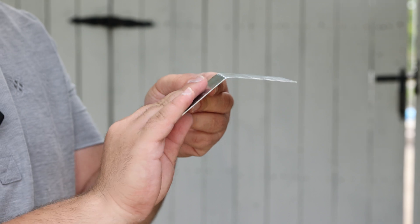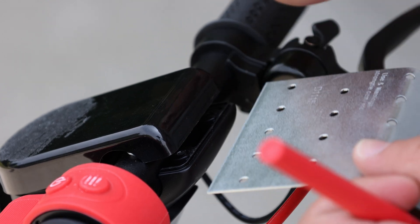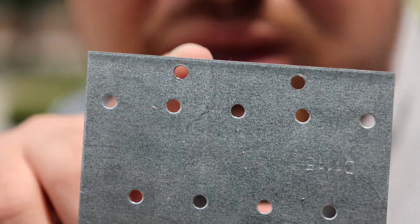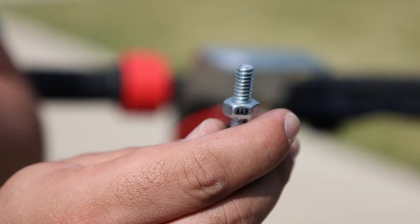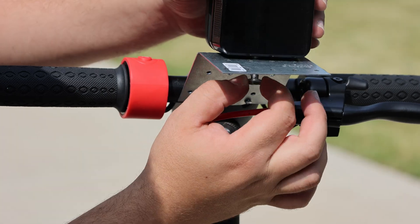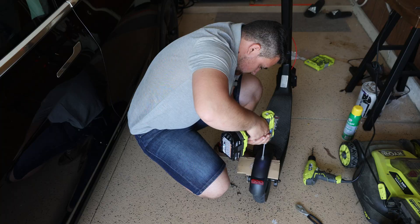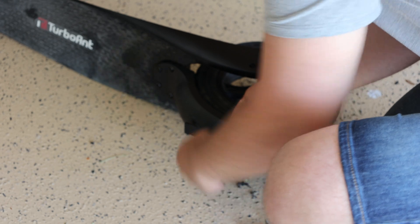With the plate bent, this part goes into the scooter and this part will be flatter, allowing the iPhone to map more of the scene. I mark where the screws belong, attach a one-eighth inch drill bit, and drill two holes into the metal plate. The two holes are spaced correctly to attach to the front of the electric scooter. I tighten the screws that were holding the screen and the plate is on. Then I use a quarter-inch thread on the bottom of the Viadoc to hold the entire system in place, screwing the iPhone and Viadoc in tightly.